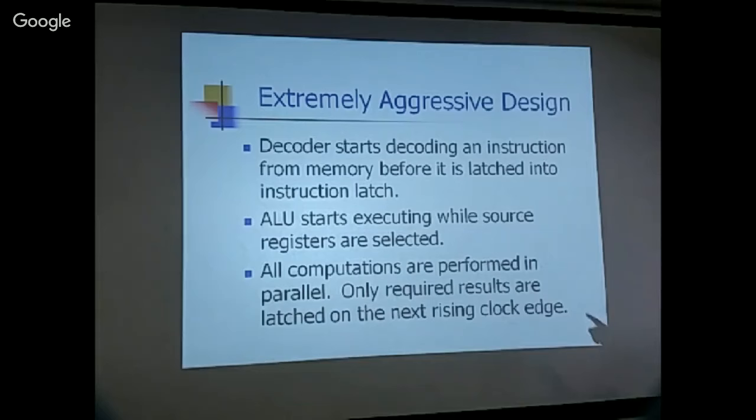But the instruction latch is important in this design, because when you have a multiple byte instruction, you have to remember the instruction, and then you can fetch new data on the data bus. The instruction is gone if you don't latch it. So in multiple byte instructions, you latch the first byte into the instruction latch, and then you fetch the data, one or two bytes. Now the instruction is in the instruction latch, and you use that information in the decoding logic, produce all the right results, and then latch them into the registers that need new information.